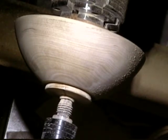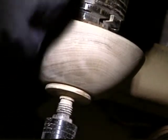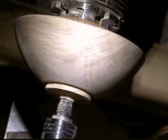When you end the piece sanding, are you ending it with a pad? What I like to do is when I'm all done, I actually use my hand with it off of the lathe. Because if you're really trying to get rid of the marks, there's nothing better than taking the piece of sandpaper in your hand and saying, on this side of the bowl, I can sand this way, right? And then you go 180 degrees and those are going to come out real nice and easy. Any sandpaper marks will blend in the grain beautifully.